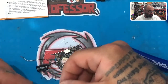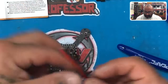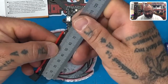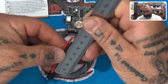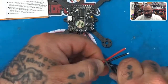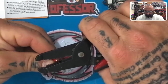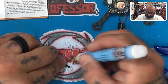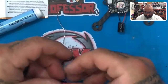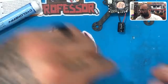The only other thing left right now is to get our XT30 done. The way this quad is built, the battery goes underneath — you don't need this full cable length, it's really long. I'm going to cut it down. From the end of the XT30 it's about 70 millimeters — I'm going to cut it down to about 40. Measure it out to about 40mm, that'll be a good length. Cut that, strip those wires, get your flux on them — the solder holds so much better. Twist those up and tin them.